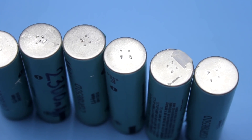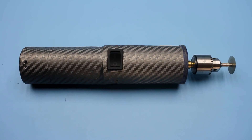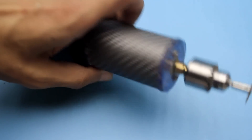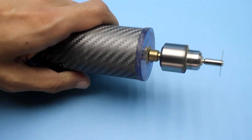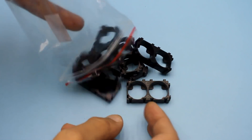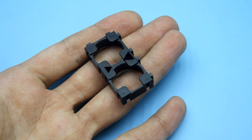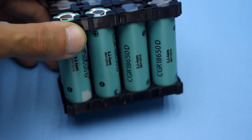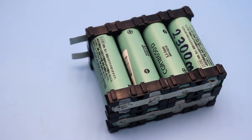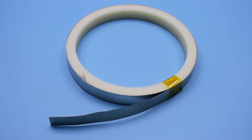I removed the traces of the old welding by using my favorite tool — how I did it was shown in one of the videos, a link can be found in the description. Earlier, especially for this project, plastic cells were ordered from China. They are used to assemble batteries using 18650 cans. The cans were connected to each other with the help of nickel busbars. The busbar parameters will be specified a little later.